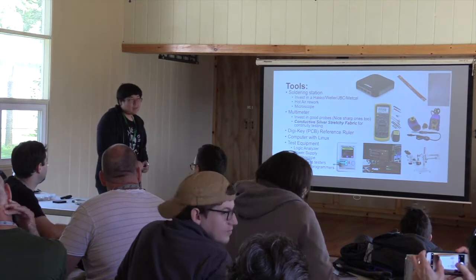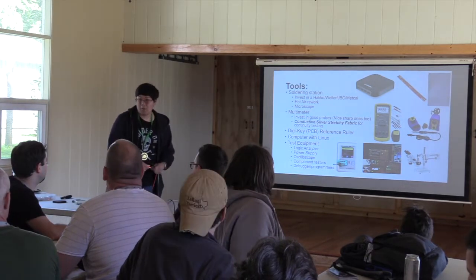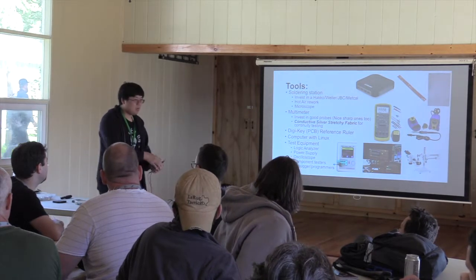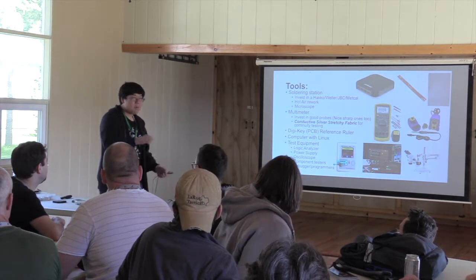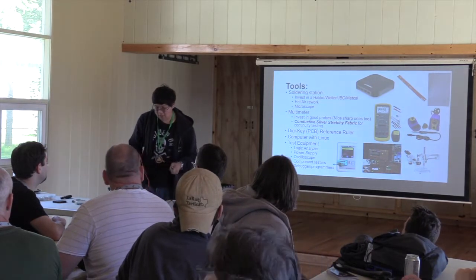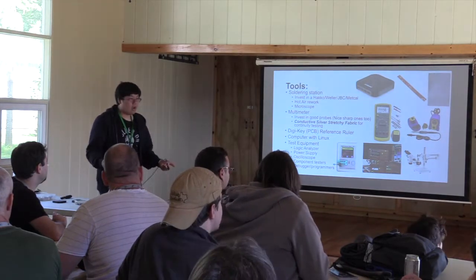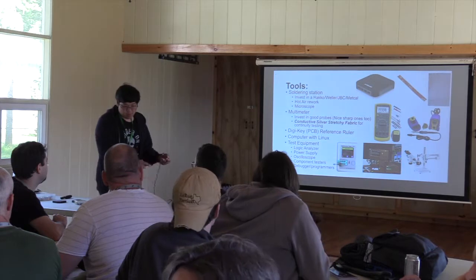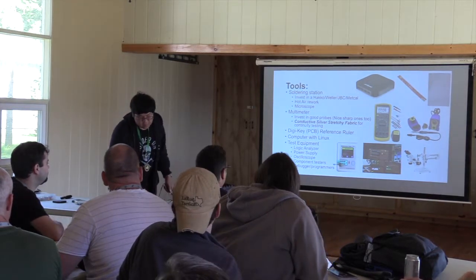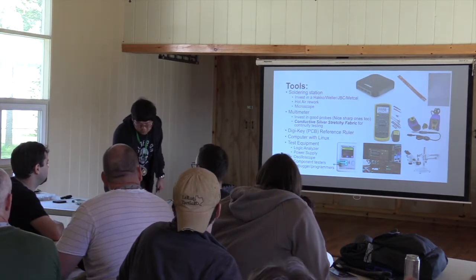That's some fabric that you could probably find at Adafruit or SparkFun for wearables. It works wonders. You just clip one lead of your multimeter to it and then you just kind of brush around. Unpower the board, obviously, otherwise it'll short stuff out. But I'll just have it hooked up to a signal wire, and I'll just search around the board. I've saved a ton of time instead of waiting for x-rays from other people to look at their signal traces.